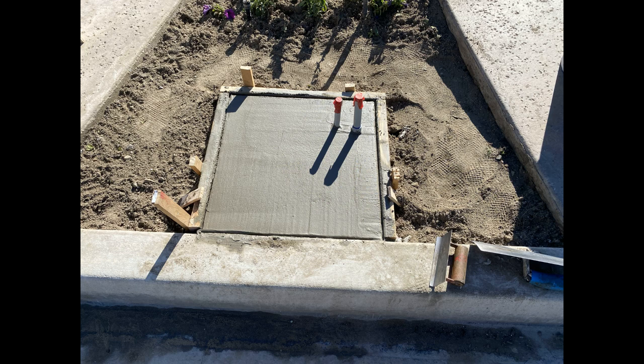This was about four or four-and-a-half 90-pound bags of ready mix. We weren't super clean with the digging out underneath the footing, but ultimately we wanted to give the mailbox a nice sturdy base and give it some weight in case something were to run into the box. This probably goes without saying but you want this concrete pad to be level, which may or may not match your curb. In our situation the curb is parallel to the street surface at a pretty good grade — we've got about a half-inch of deflection across this two-foot concrete pad, with the right side about a half-inch lower than the left side relative to the top of the curb.